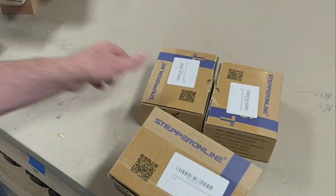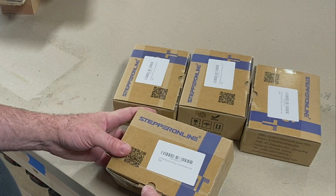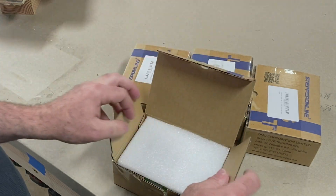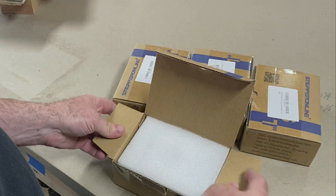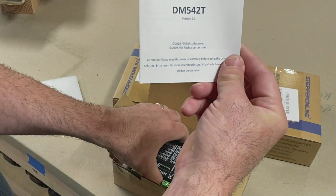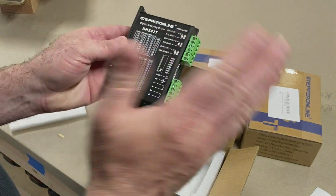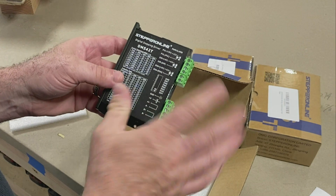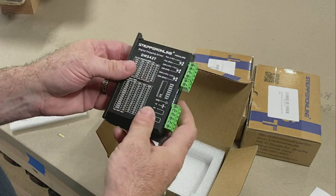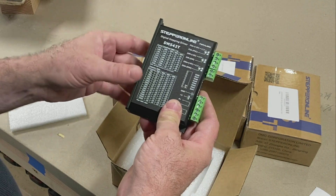I just purchased replacements. I decided to upgrade to some stepper online motor drivers. I did some research, tried to stay within budget. I do need four drivers. I'm going to wind up going with the DM542T. This guy is a little bigger, it's supposed to be much quieter — we'll find that out soon. And it has a soft start, which I like. Turning the unit on and hearing that jump, I really don't like that to my motors. This should make things run smooth, stop losing steps, and be quiet.